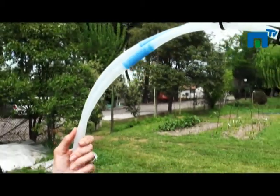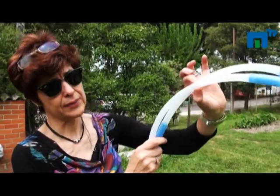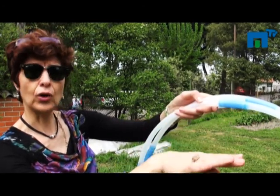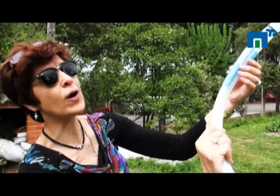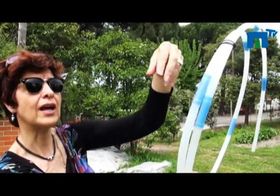What is this labyrinth structure required for? In a drip irrigation system, water is discharged drop by drop near the plant. The pipe has a pressure above atmospheric pressure — that means over one bar — so we need an element to drop off all that pressure, keeping it close to atmospheric pressure. The labyrinth serves this purpose: water enters the labyrinth, moves along it, and then discharges from one or two outlets at atmospheric pressure — and that is where a drop forms.